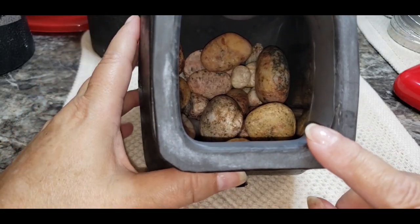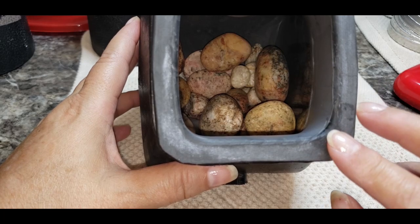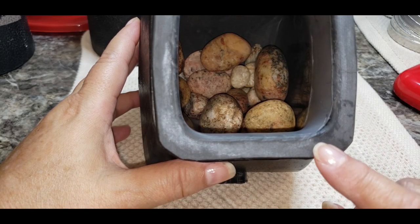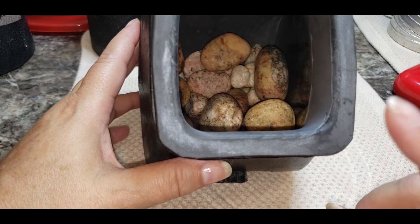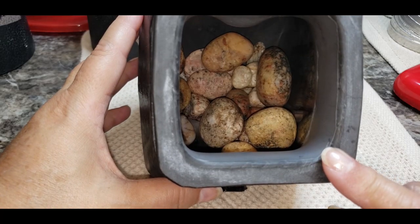and we're going to add the polish ceramics to this. We're going to get everything in the barrel nice and wet. Then we're going to add 1 tablespoon of borax, 2 tablespoons of the 2-micron aluminum oxide polish. Put this on the vibratory unit, and we'll see it in about 3 days.